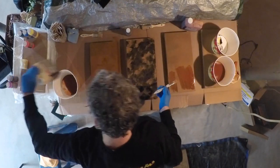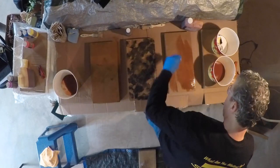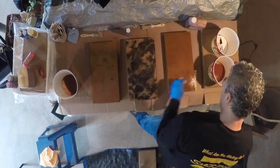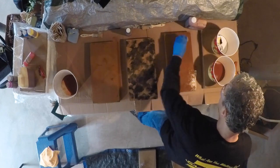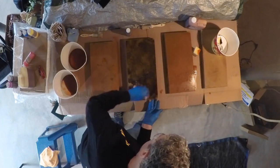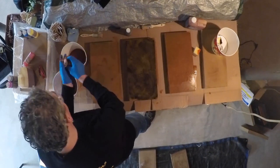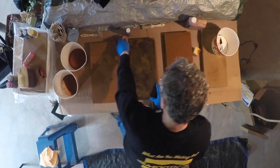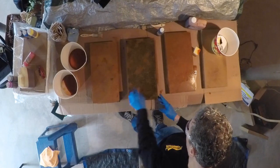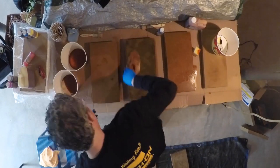Our maple is really coming on to this. Remember — you're not painting concrete, you're staining it. What I like to do is then immediately just come in with a sponge and give that blot technique again. A lot of this is more art than science. There's probably a little too much black to begin with here, but they're relatively forgiving when it comes to adding more and taking it away — easily cut with water. I'm using full strength here today. Already it's starting to get that antique look — the brown brushing out over the black pretty nicely.